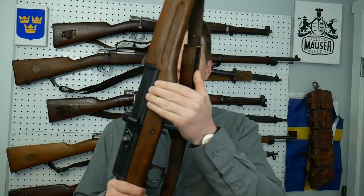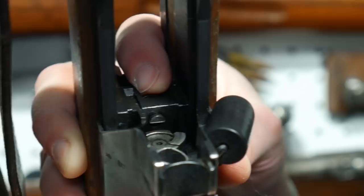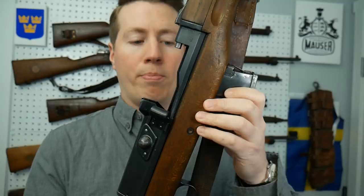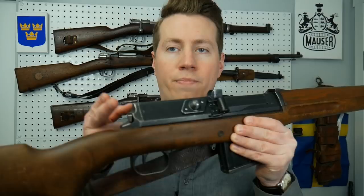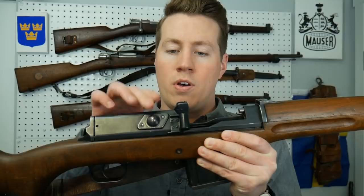So the gun does not do this with the magazine inserted. With the magazine in and the safety off, when you slide this bolt forward and all the way back, it doesn't go forward. That's because this rifle actually has a bolt hold open. What's happening is that the follower of the magazine is pressing on a little detent, and it's just that little detent that's holding the bolt back. So if you see it normally — right now with the safety on, if I pull that bolt back, the dust cover is holding it by the little catch that's on the bolt. That's the way it's being held right now.